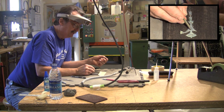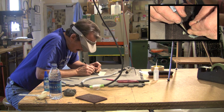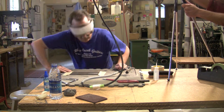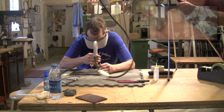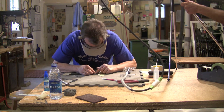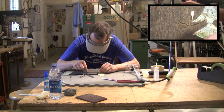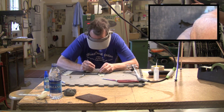The tulip goes in and it picks up off of this little line right here on the other side. That set of lines came out very nice. It's just: hit the points, then connect the dots. With this sweep, I'm going to make a series of little punches — the little punches make drawing out that stem a lot easier. There is a little weakness: pearl has a grain just like wood, and the other side broke the same way. But it will fit in here.